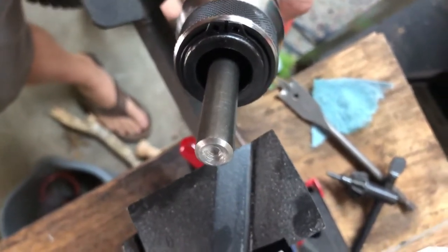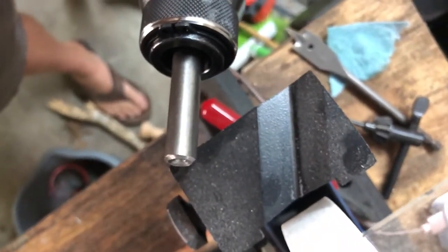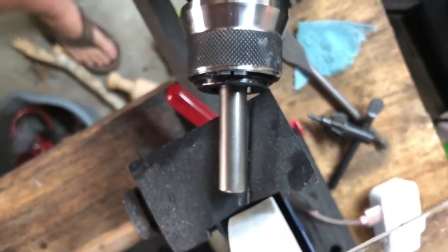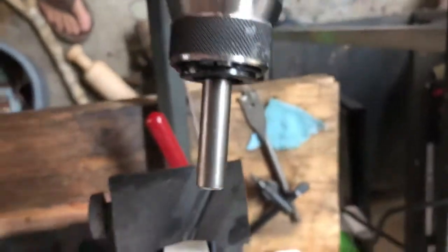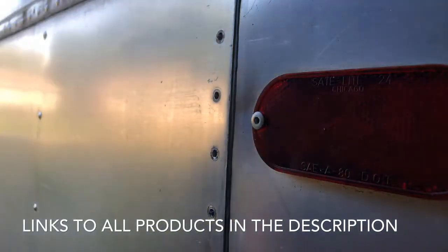I took my tool and put a chamfer on there because it was leaving smileys. It was pretty flat, not tapered — I got a 45-degree sharpening tool, took it out of the gun, and just twisted it on. Here's an example of the bucking bar we're using — you can get it on Amazon, I'll put links in the description.